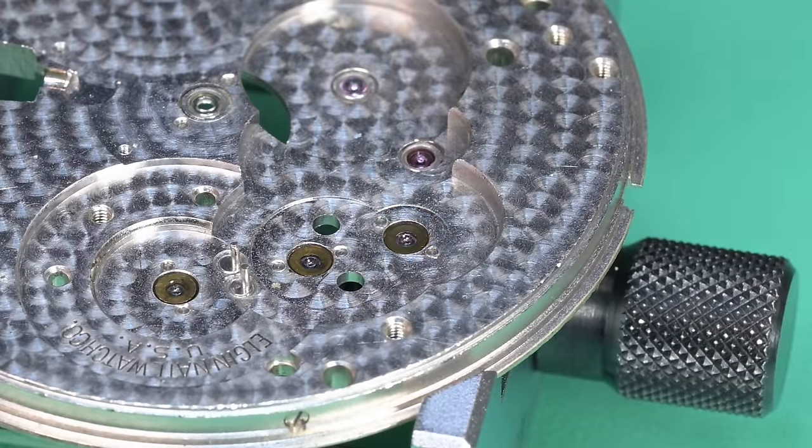Now we can apply some heavy grease to the center stud for our second wheel where our cannon pinion is going to go. We can press down our cannon pinion and make certain that it's actually pressed all the way down — no problems. A little lubrication for the post on the minute wheel. I'd like to take this opportunity to say a heartfelt thank you to the patrons of this channel — special shout out to Cole and Tony, our two newest members.